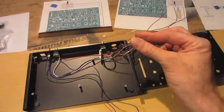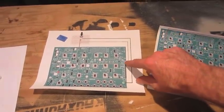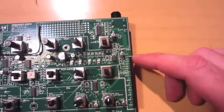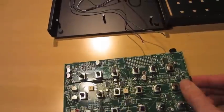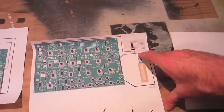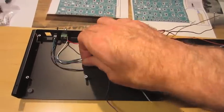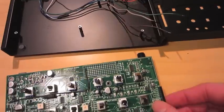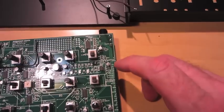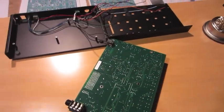So now I'm going to solder this gray wire which is the center wire to my volume pot. That comes around to the VCA end, so I will solder that on the bottom — that's for the volume. For the pitch bend, the diagram, we're only using the center blue, but the blue runs over to my switch, which can select between the purple and the green wires. And those will wire in to the VCO linear and exponential — so pins 1, 3 and 4 if you're looking at it from across here. So we'll go ahead and make those connections now.